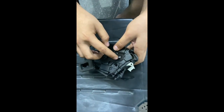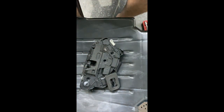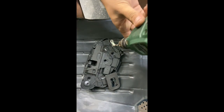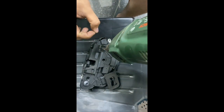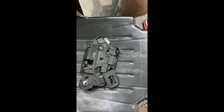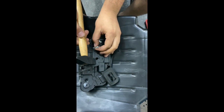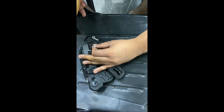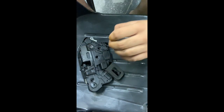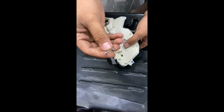There should be a small pin here — I've already drilled it out. Essentially what you're going to do is grab a drill, get a 5mm or 6mm drill bit made for steel, position it over the pin and drill it out. Then you're going to need a small nail to place in there and tap that pin out. It is in there hard so you'll have to use a little bit of force. That's it — we have the pin out.